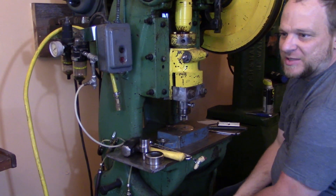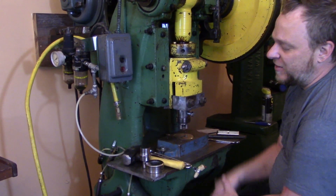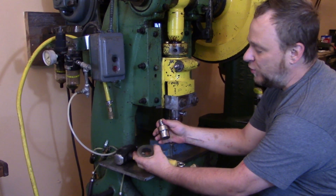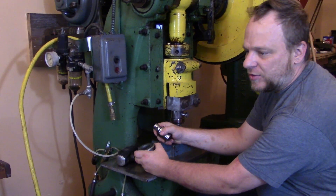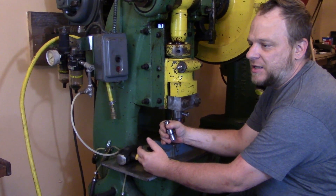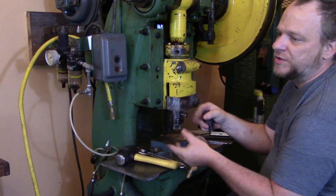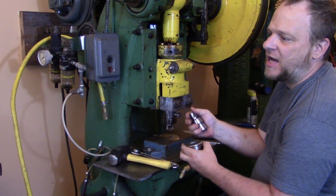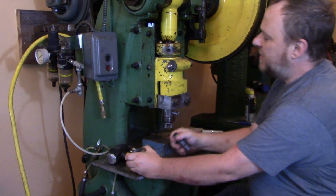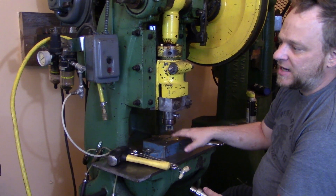Mostly, of course, in the business of coins and metals, most things are round. So the setup is fairly simple. In this case, we use what's called just an open tool. A lot of times in some of your larger or more high-speed operations, all of the blanking or stamping is done inside of a die set, which is an entire system of tools used for lining up the punch and die and making sure everything stays lined up and the clearances stay the same. In this case, it's just what's called an open tool, meaning we just have a hammer and an anvil that's set up independently of each other.